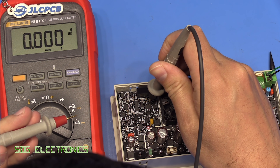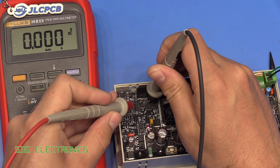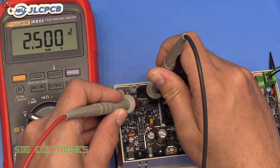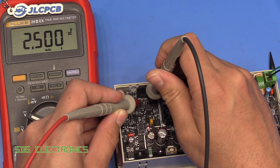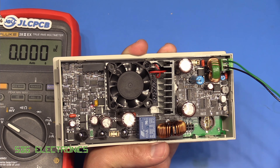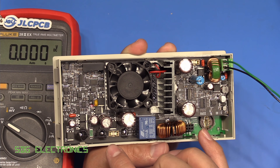I think this is a ground pad on the little programming header, and then there's a little capacitor which looks like it's connected across the 2.5-volt reference output from that DAC. And that's bang on 2.5 volts. Firing up the Agilent 6.5-digit meter — a quick look on the Agilent 34410A and we're just a couple of digits out, so that's pretty good on that reference.